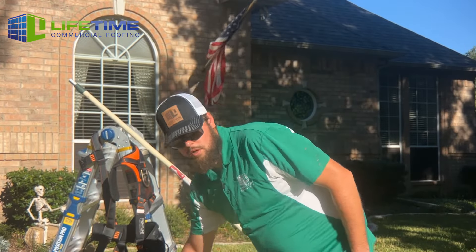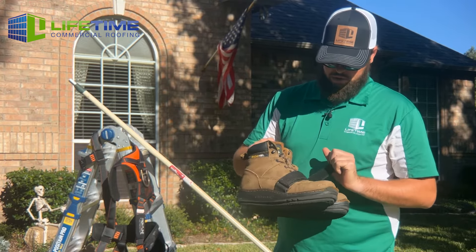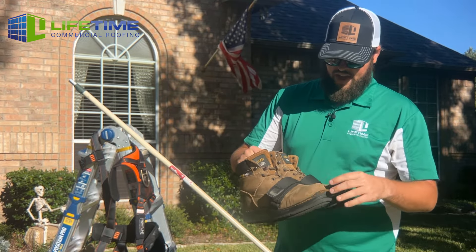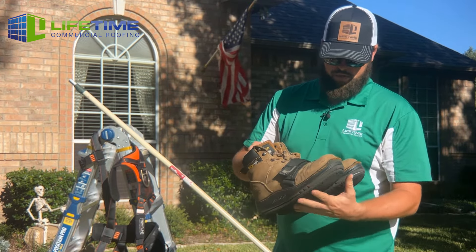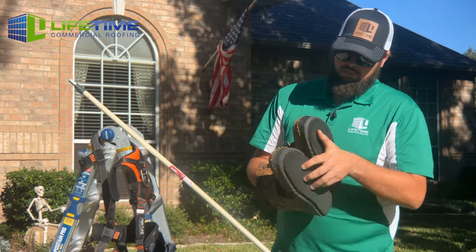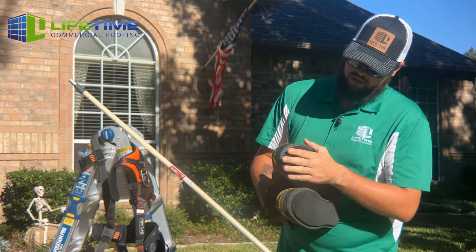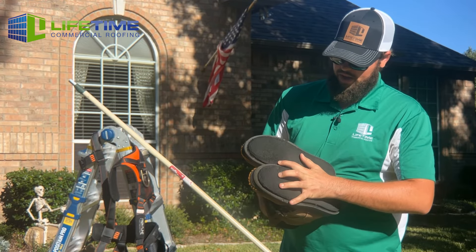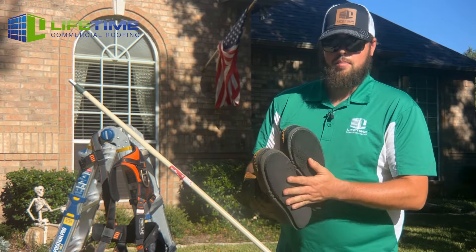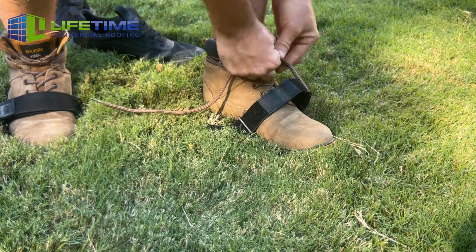First thing we're gonna look at here is Cougar Paw Boots. These have straps that interface with the sole, not the actual upper of the boot. That keeps the bottom of it — which is what grips the roof — attached to your feet, so this strap is actually more important than the laces. Down here on the bottom it has removable foam soles because these do get torn up. It's important that you check the soles before you use them every time, because if you get up there and these aren't gonna work, you could slip — and you don't want to do that while you're on the roof.